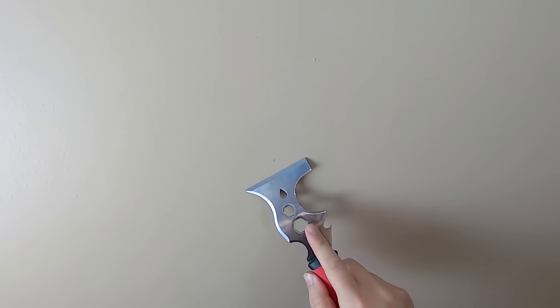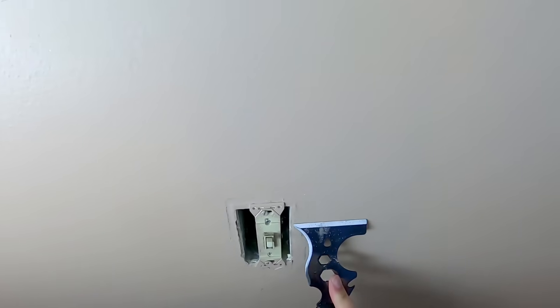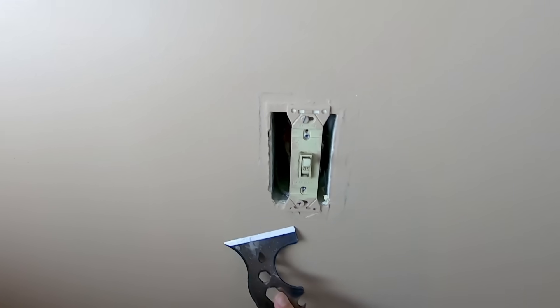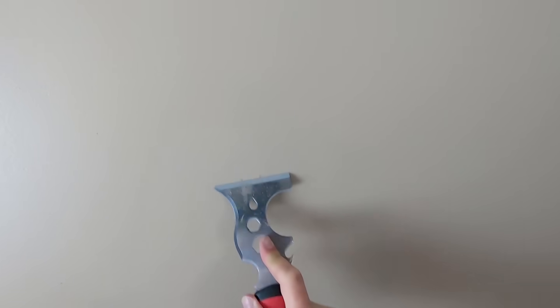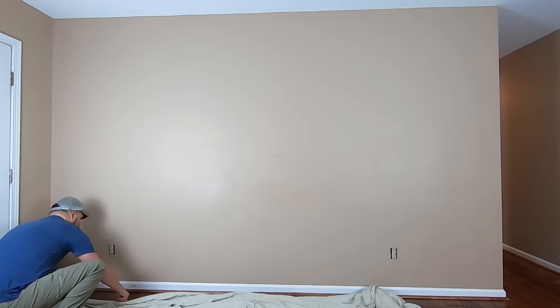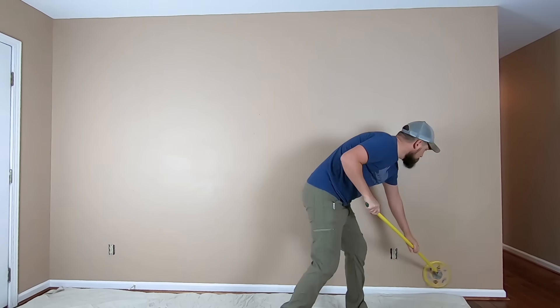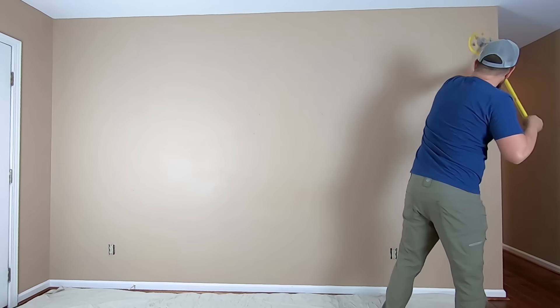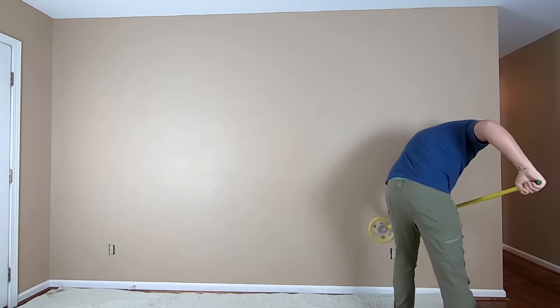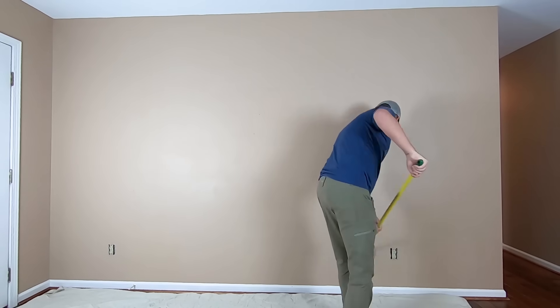Use a five-in-one painters tool to scrape off any larger imperfections you might see, like a paint drip from the previous paint job — things that won't sand down when we do the light wall sanding prior to painting. Use a drop cloth or contractor's paper to cover the area you're painting. Sanding the wall removes minor imperfections and helps the new paint bond. Round wall sanders are easier to use than the older rectangle wall sanders that like to flip when you're using them, giving you more things you need to fix.